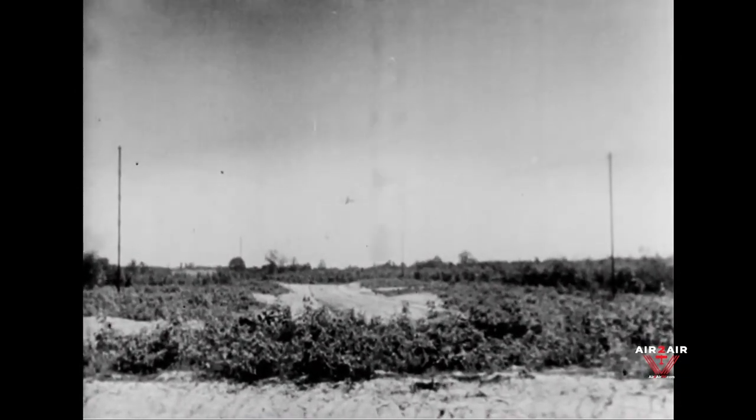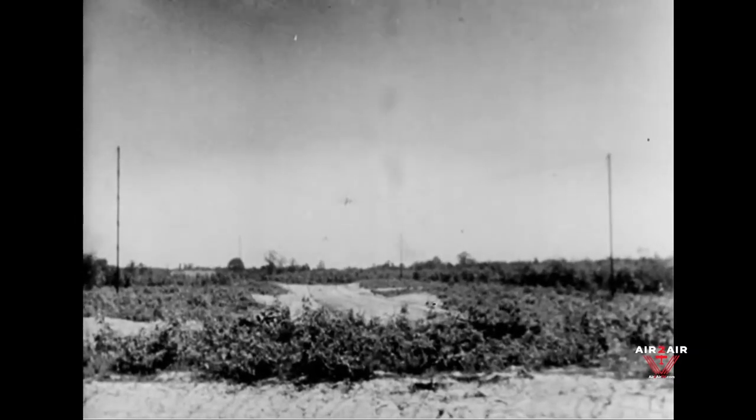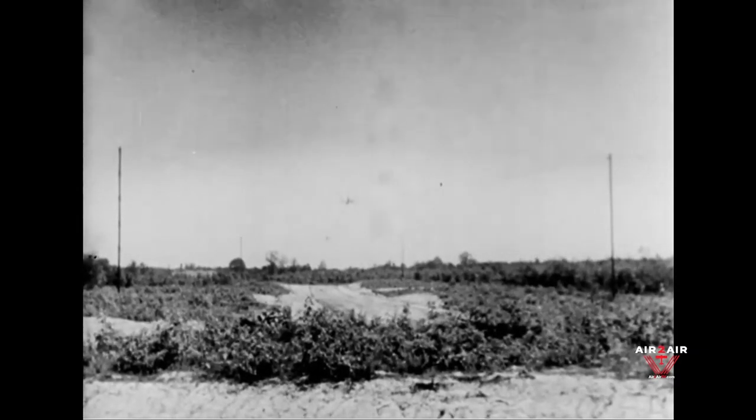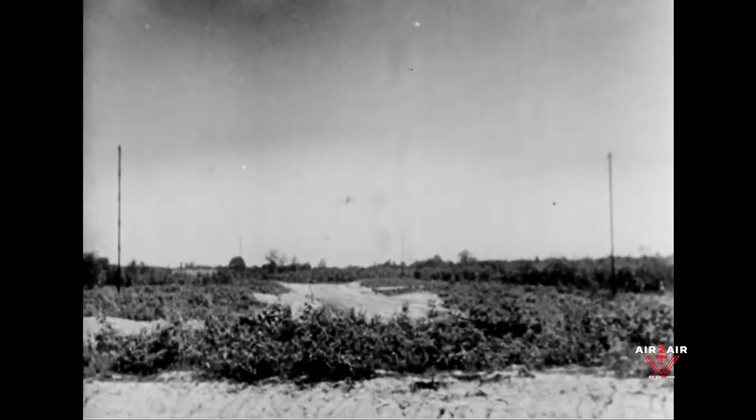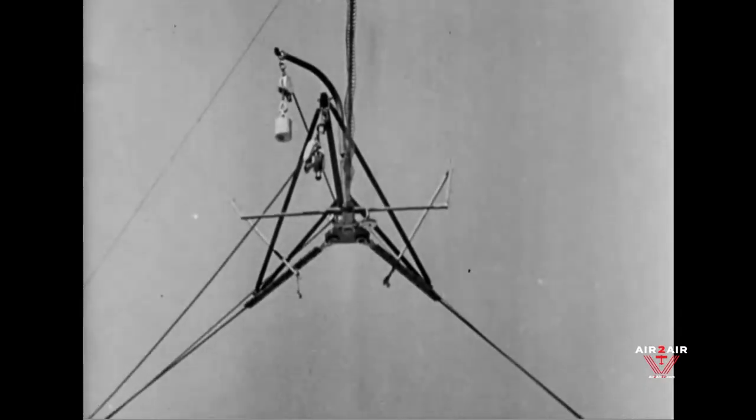Four masts hold up the runway cable. The runway is suspended at each end by a V-shaped bridle cable. The bridle cables are really prolongations of the runway cable. Each bridle cable runs over a masthead sheave and is anchored to dead men sunk into the ground.